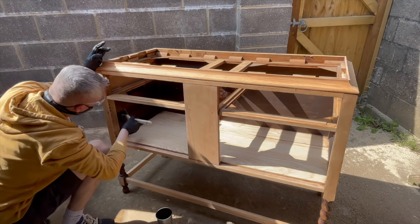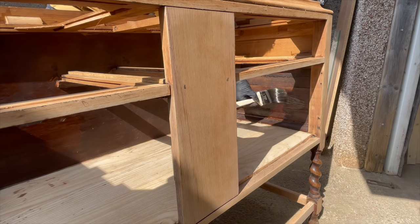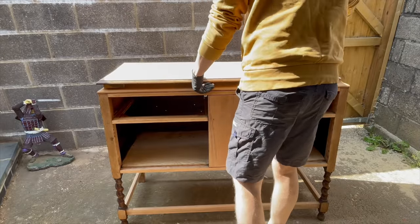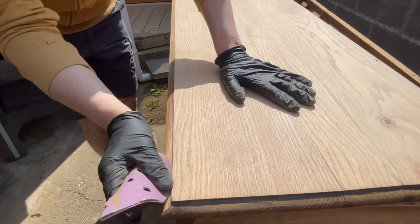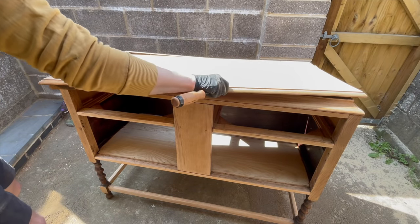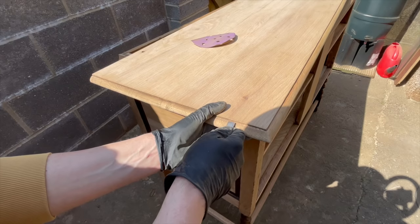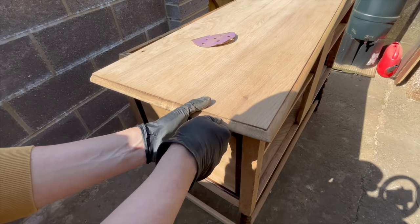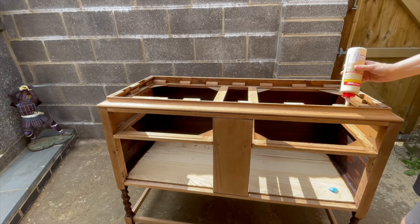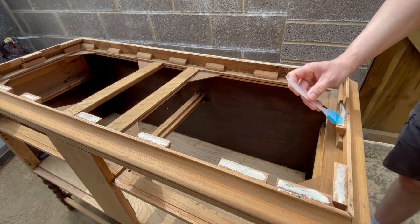I sanded the bottom of the inside but for the sides I decided to use Restore-A-Finish. Before touching the top I did a lot of touching up — hand sanding and chisel work — just to make sure the whole piece was nice and clean, including all the tight spaces, edges, and corners. Attaching the top wasn't very straightforward as it was a little bowed, but with lots of glue and clamps it worked just fine.